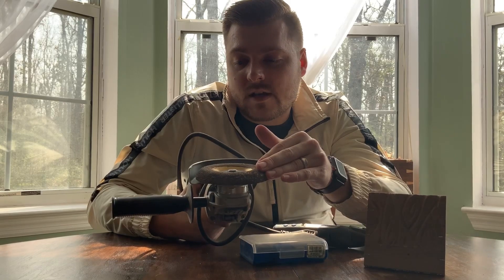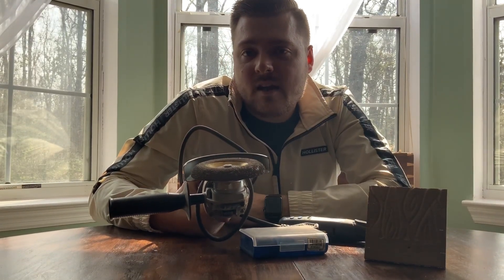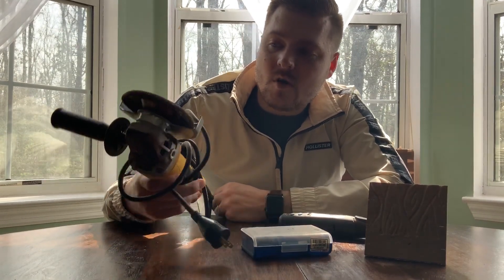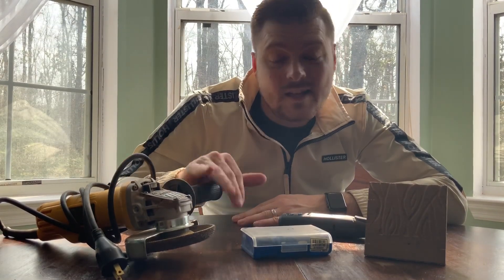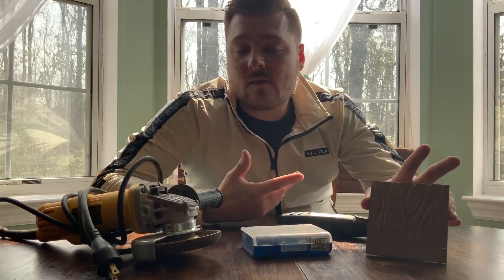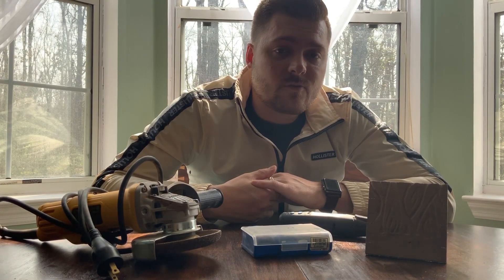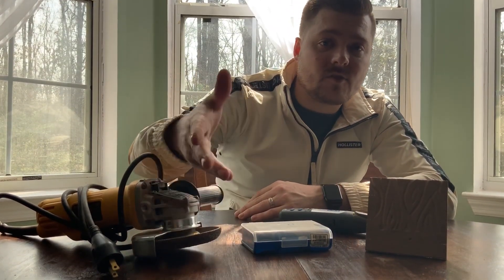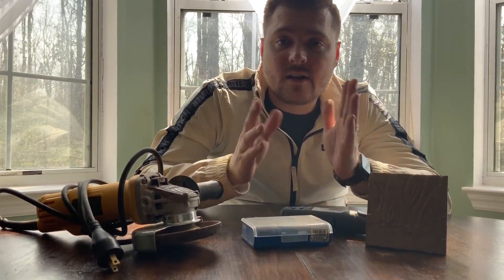This is made by Kutzall and it's a burr style — the same thing you'd get with a Dremel but in a disc shape, and it's cupped. I liked it because it was relatively safe compared to the chain ones or disc ones with blades attached. All in all probably about 100 to 120 bucks to get started. If you want to make big tables I'll show you that next. If you just want to power carve small wooden boxes or things around the house, go with a Dremel, but for deep furniture work you'll need the angle grinder setup.